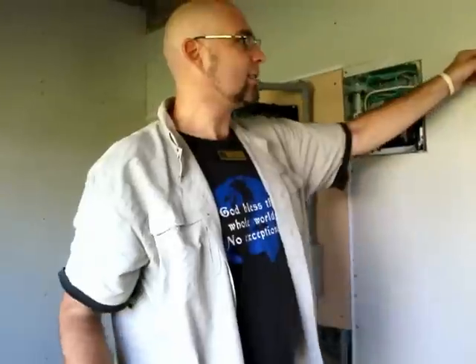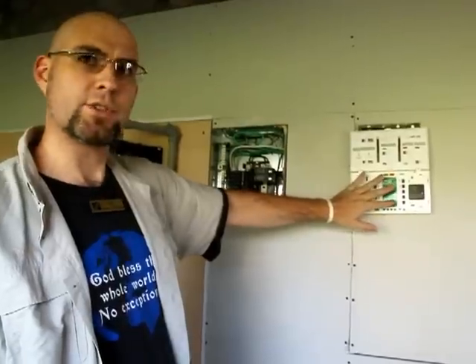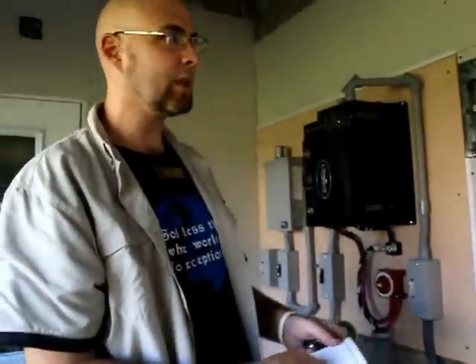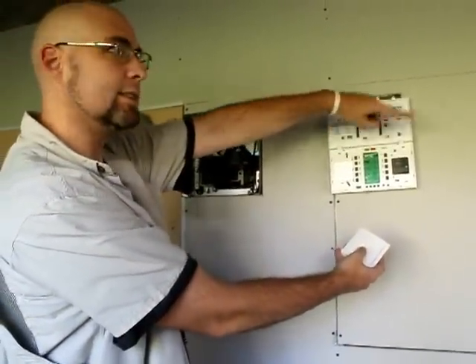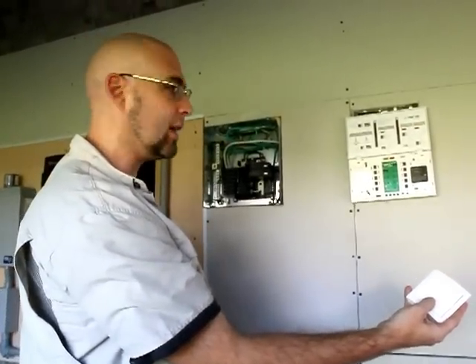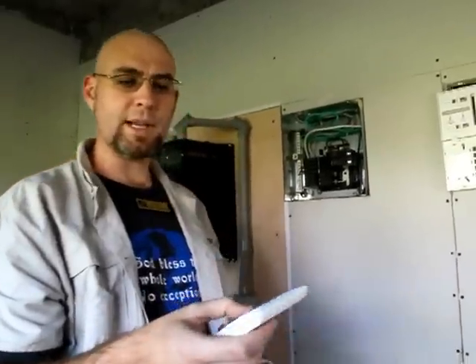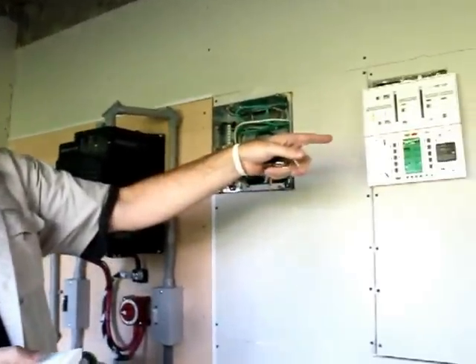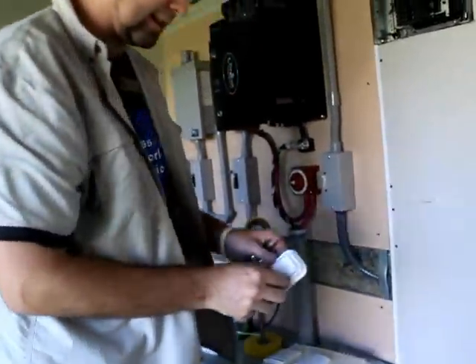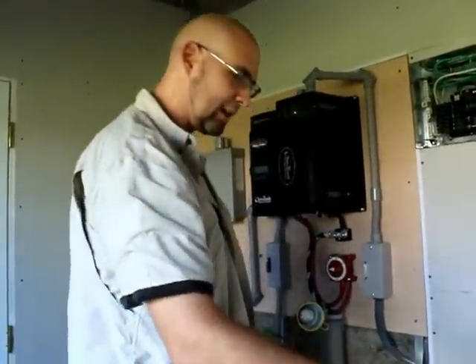This is like a normal house panel. In addition, Verve Lighting Systems was kind enough to donate this unit, which has wireless remote control of 10 circuits. That means we can have cool switches like this — you see when I turn this on that exterior light goes on, and when I click it again it goes off. You can also build in dimming features. What's cool about this is it uses piezoelectric technology — just the force of me pushing on it generates a small radio signal which turns the light off or on. There are no batteries; this will never run out.